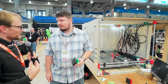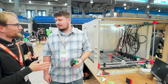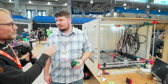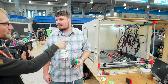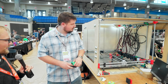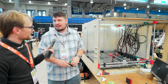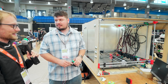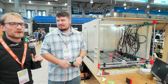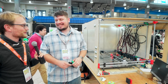So the docking procedure grabs a new insert automatically — that makes perfect sense in a tool changer. There's also a subtractive head with a small brushless outrunner motor with an ER8 collet. And there's a laser that is not powered up and not plugged in, which makes a lot of sense for a printer like this.